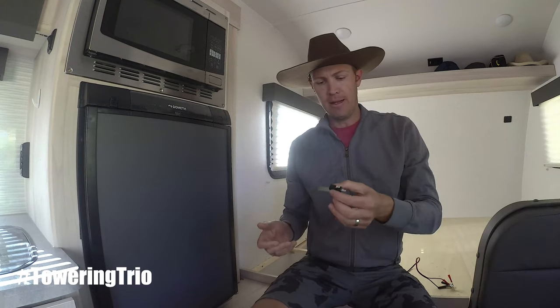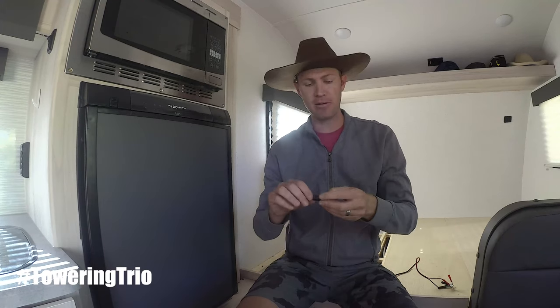We cleaned it out and it worked for a couple more days, then it stopped working again. We actually hit some snow in Flagstaff and I had to do something about it — Stephanie does not like the cold. So I had to fix the furnace a second time. If you watch that last video, Stephanie points out there's a light that flashes after that 30 seconds of the motor blowing but not moving on to the next step — it will blow for 30 seconds and then shut down. That's one of the symptoms to look out for.